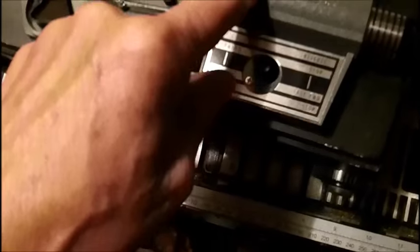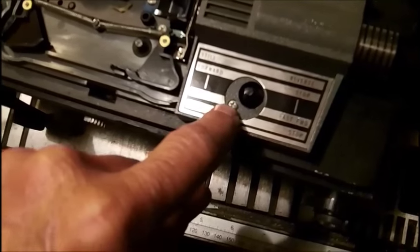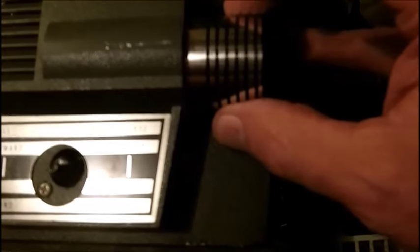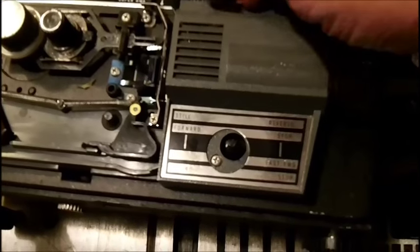This is supposed to be a zoom lens. I took this off — it's a little hairy getting off. You have to pull the knob off, the main function knob here, and there's a Phillips screw right here. You pull this off and there's two tabs — plastic tabs — you have to be very, very careful. But before you do that, you have to pull this little tiny plastic knob off the focus here. I stand corrected — this is a zoom lens. It just did not want to move, probably because it's cold. If I gently pull it, I can see I'm pulling it out. What threw me off is it was still moving in and out for focusing. So you just push it back in — go real slow. You don't want to force this because it could strip the little grooves that operate this lever here.